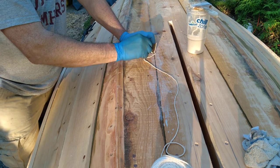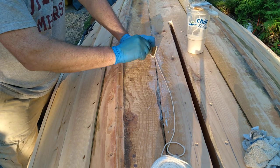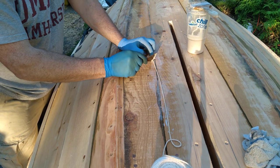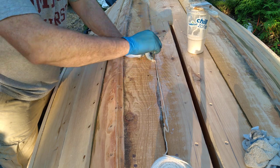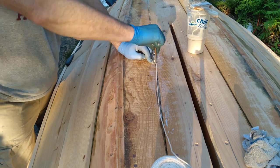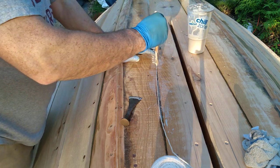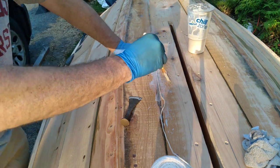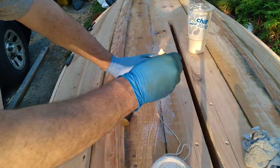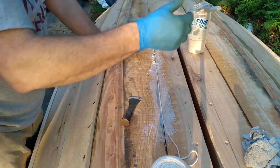There's not a whole lot of caulking, even in traditional dories. The laps are just a wood-to-wood, watertight fit. The bottom is traditionally caulked, and then you'd have caulking along the garboard, which gets sandwiched in between the garboard and the bottom when you're nailing the garboard on, so it's not really hammered. It's just put in with paint and nailed in underneath the garboard plank.